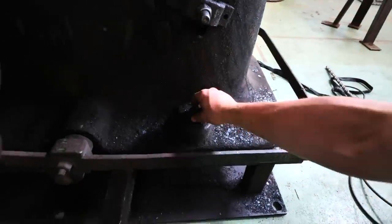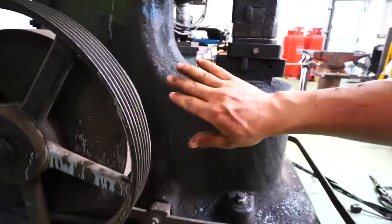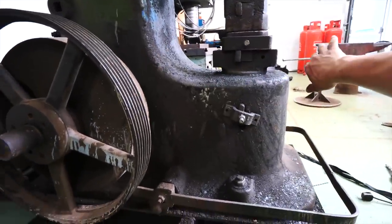The way that I think I'm gonna try and solve this issue is I'm gonna unbolt 3 of the bolts that hold the Pilkington to the base, crowbar it, pivot it on the crowbar off to one side, which should enable me to safely get access to that last hole. I'm gonna crowbar it last, and I think that'll work pretty well.